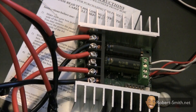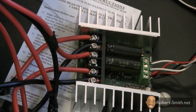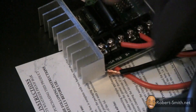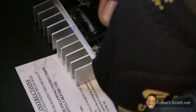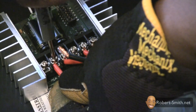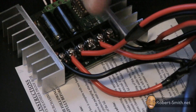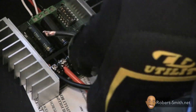I'm taking out the negative battery connection and putting it off to the side — make sure it can't touch anything. The connection I'm going to switch is the first motor, the left motor. I'll unscrew these screw terminals and reverse them — since the lead was going into M1A, I'm going to have it go into M1B instead. That should do it, so I'll go ahead and hook up my battery connection again and test it with the transmitter.